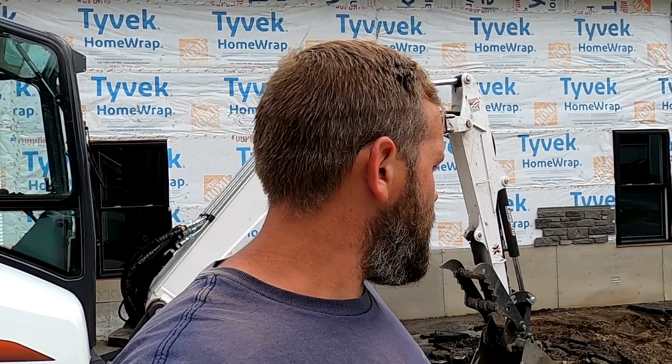But it's going pretty smooth here, going pretty smooth. And the good thing is it's a pretty nice gravel soil underneath it. So we'll have to do just our regular excavation, about 8 to 10 inches down, leaving 6 inches for 3/4 inch crushed stone, an inch for our chip stone, our bedding material is what I mean, and then our 2.5 inches or so for our paver.